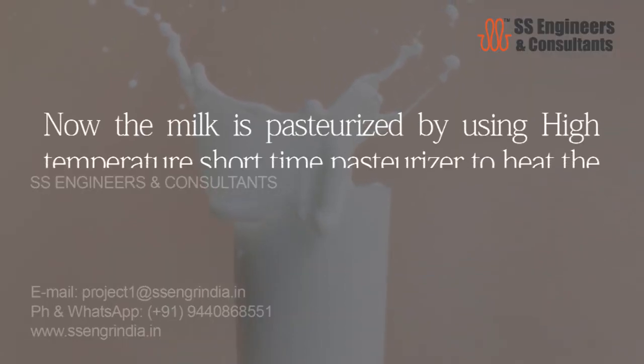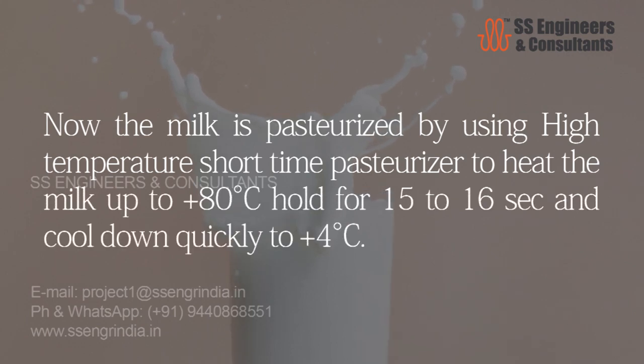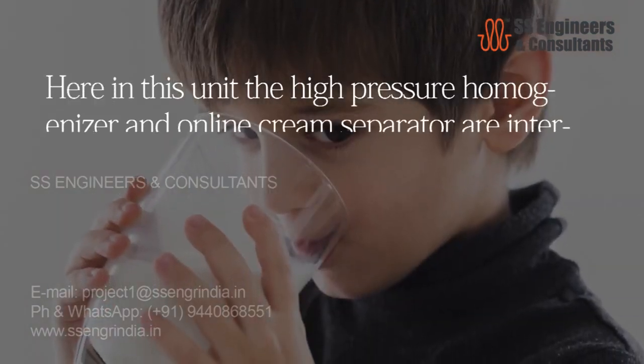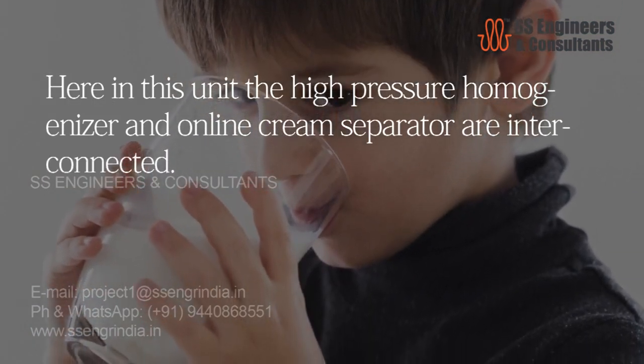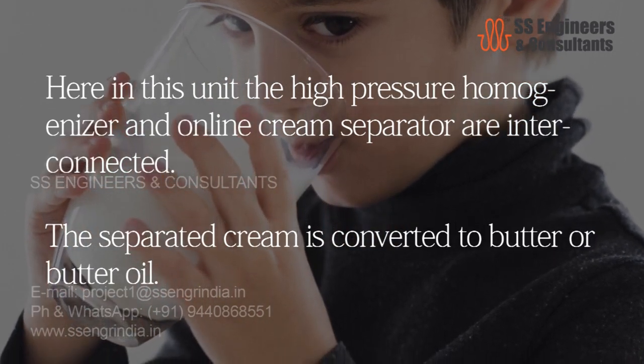Now the milk is pasteurized by using high-temperature short-time pasteurizer to heat the milk up to +80 degrees Celsius, hold for 15 to 16 seconds, and cool down quickly to +4 degrees Celsius. Here in this unit, the high-pressure homogenizer and online cream separator are interconnected. The separated cream is converted to butter or butter oil.